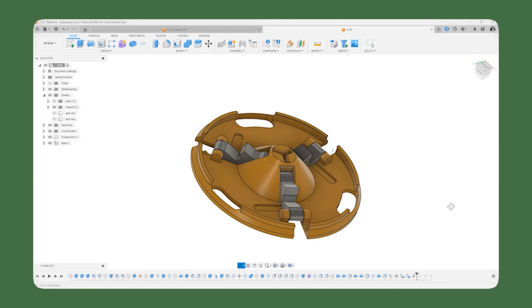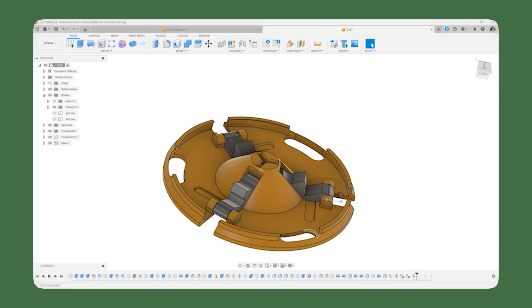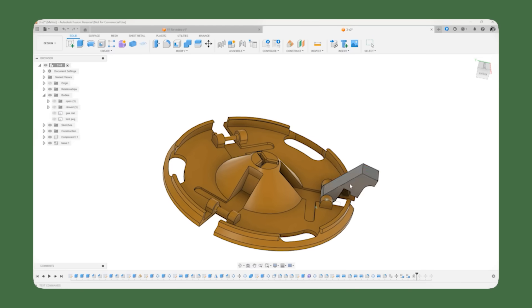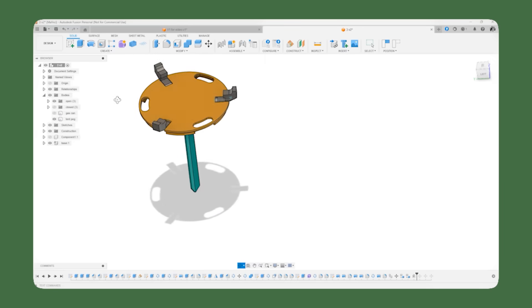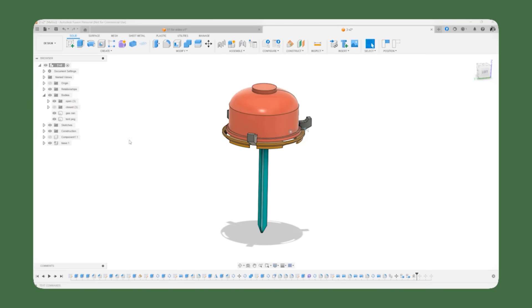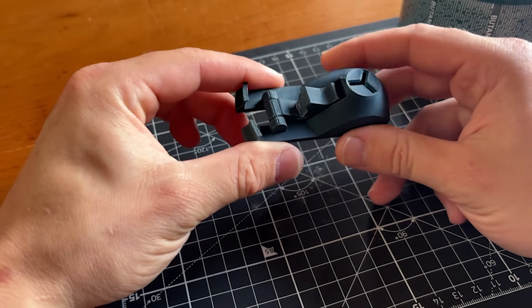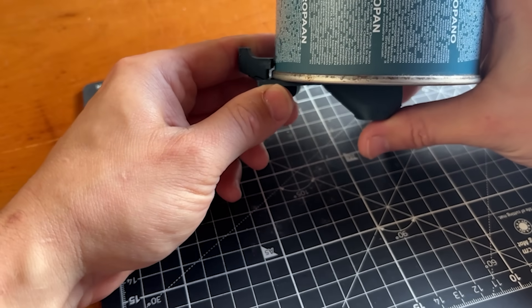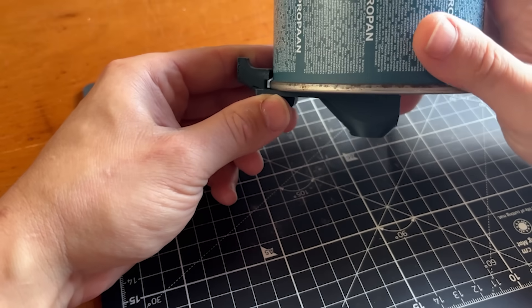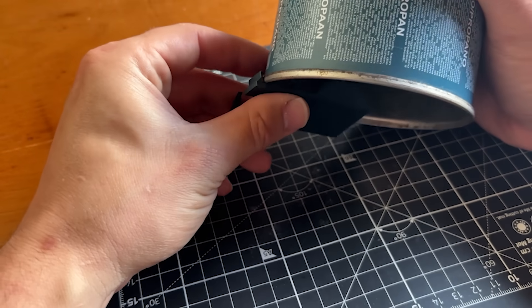This updated design is quite different from the previous one. To address the flexing clip issue I designed three more cutouts to reduce the flex force needed to pop in the gas canister. These cutouts came from the next update — these print-in-place hinging components, which fold out and around so that when the base plate is in table mode you can connect the gas canister to it, creating a secure and stable base for the stove when cooking. Instead of printing the whole new design, I used a method called split model testing to print just a small section to check fit and function. The print-in-place mechanism works really well and the latching component fits nicely, holding the gas canister in table mode. It also folds in and fits within the underside of the gas canister — win-win.